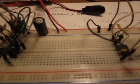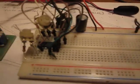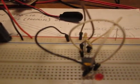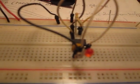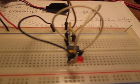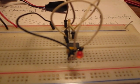Okay, so yeah, that's pretty much what I wanted to cover. One more thing I almost forgot. When you build this, what I did at first, I made a test bed, one for the 556, and I made a separate one for the 555. This way you can easily test everything, make sure, tune it, and then transfer to PCB. I can show you quickly. It takes only a minute to assemble this.